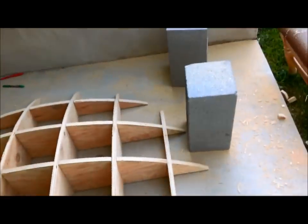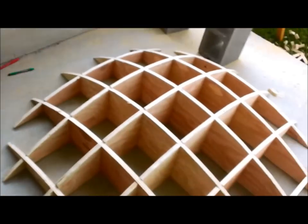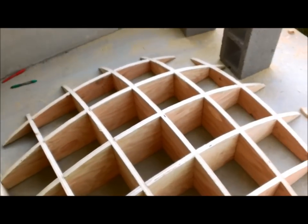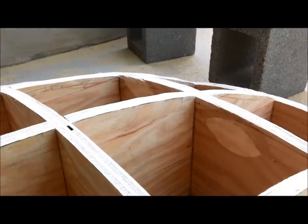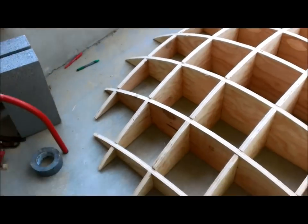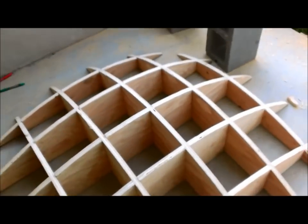We're making some serious progress — we've come a long way. Everything is put together right now. I'm probably going to get some sandpaper and smooth some edges. If you look really closely, sometimes there are little gaps. I bought some caulk that I'll go through and use to clean that up, fill the gaps. I think that looks pretty darn good. Just make sure all your cuts are pretty right on. I thought it would be harder to put the pieces in the farther you got from the center, but it's actually easier to put the end pieces in.